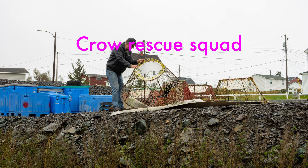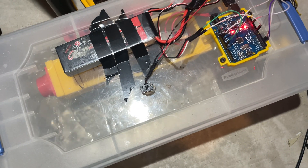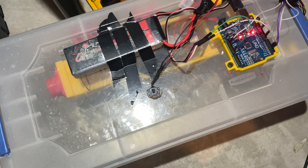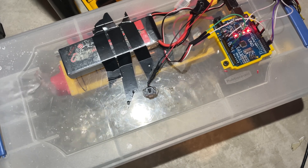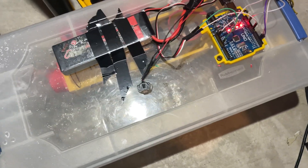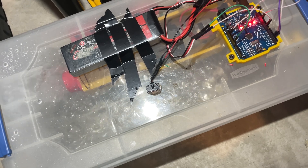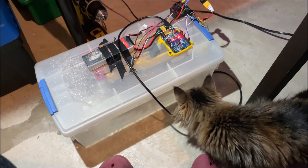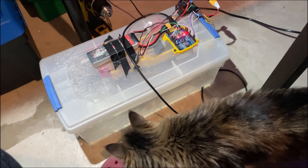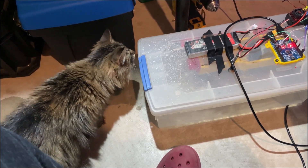I decided I wanted empirical data, so it started out with me trying to create a force tester for the jets. The idea was to have the jet push up against a load cell and measure the force in Newtons, so I could compare different impellers by the amount of force they made. The problems started with the design — I used a box I had sitting around for the shell, but motors are really heavy, so when I put the linear rail on the side it deformed the box, causing everything to be flexy. This gave really inconsistent results on the load cell, which was already inconsistent when I bought it. So I decided to just scrap this idea and move on to something new.